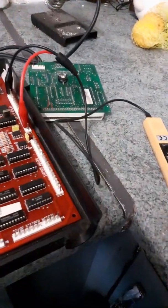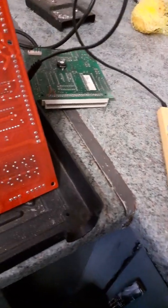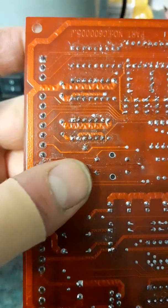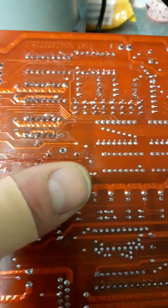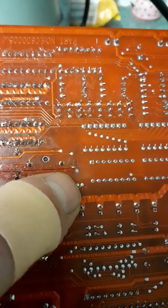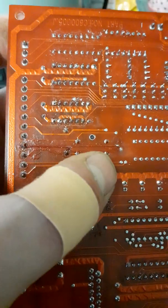And then we had some tracks as well. I actually did the tracks before, because someone plugging 50 volts in, like I say, is never going to be good, and you're going to do some real damage. Where are the tracks I've done? Right. Let me see here. This one here, this line right up here, completely burnt out and gone. So that's a new track there. The top of this one here, you can just see, only from the edge to there, completely burnt out and gone. You could do the whole track if you wanted to, but I've just done the bit that's gone. So we put them back.